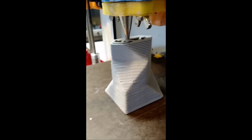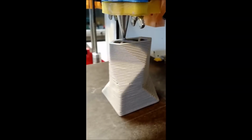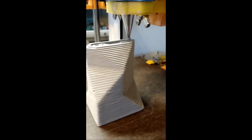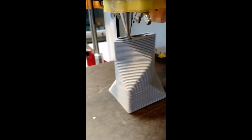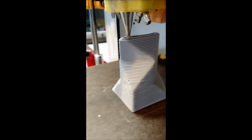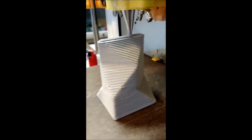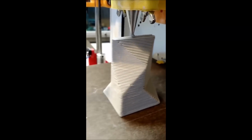It was hard to stop and start, speed up and slow down the rate at which the clay was coming out. And it was also hard to just synchronize everything. There were obviously plenty of precedents that we were looking at. We were aware of the work of Dries Verbruggen in Belgium and Jonathan Keep in the UK. Both of them had begun working with clay printing in about 2009 or 2010. And so by 2015, they were relatively adept at it. And Jonathan had even released an open source printer design based on a Delta platform using air compression as the means of moving the clay.